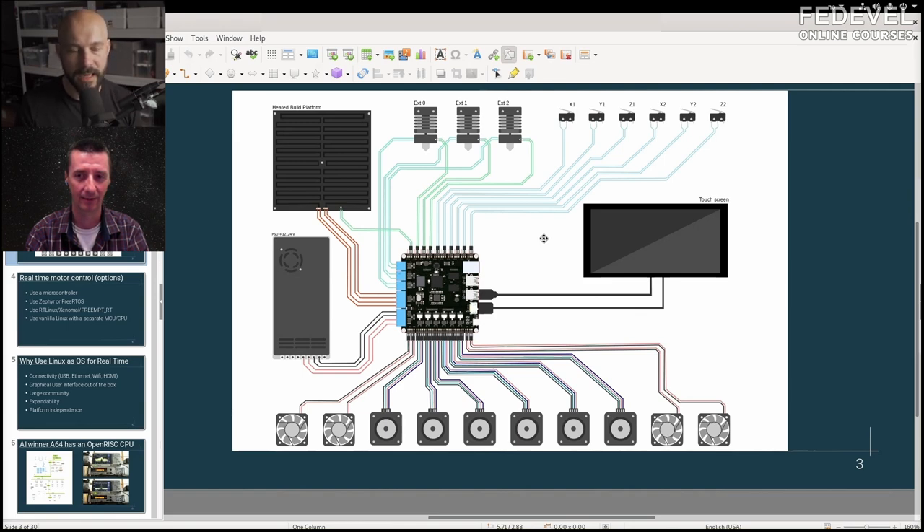There's also a way to detect if you have skipped any steps. If the stepper motor is physically hindered, you can skip a step. You use the back EMF and current draw — there's something called stall detection built into the Trinamic drivers. If the current goes over a limit you have set, you get an interrupt.